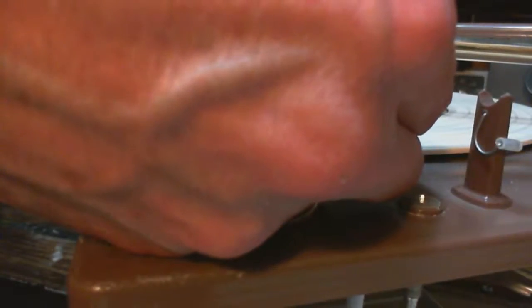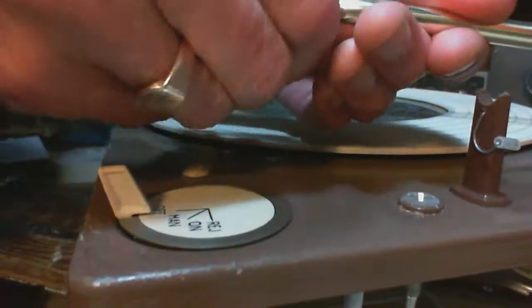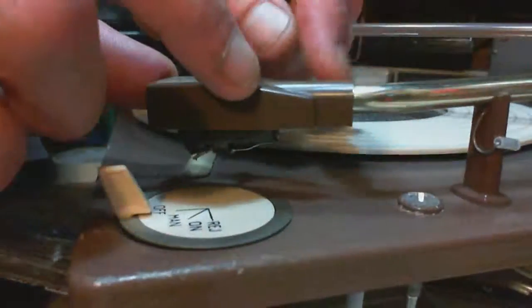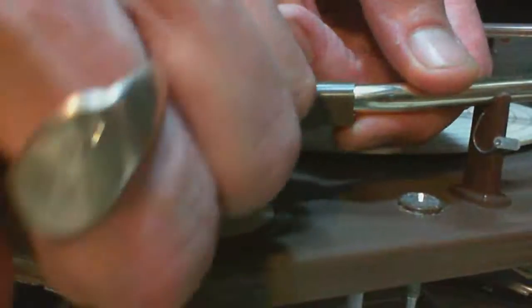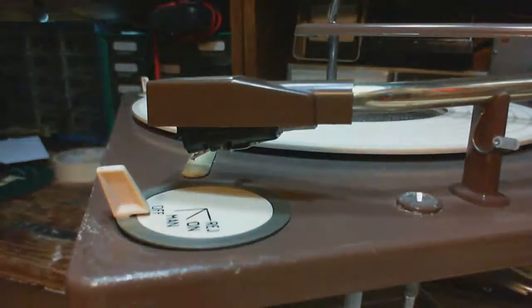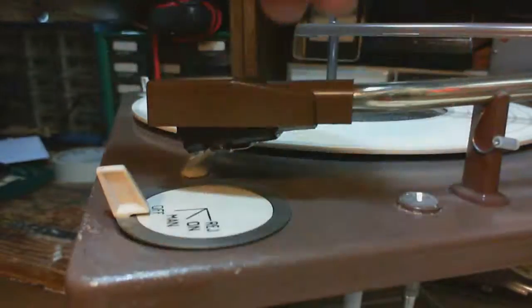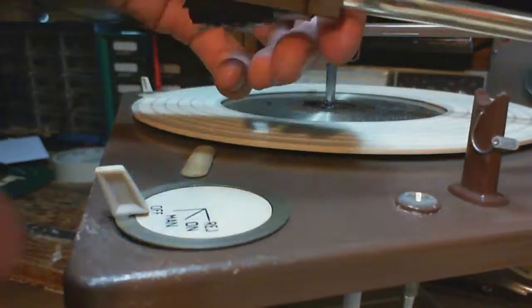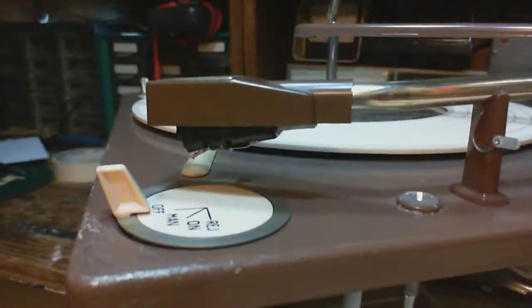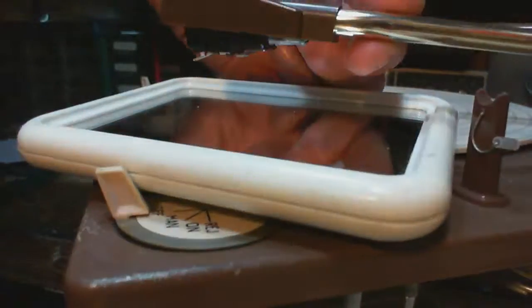We'll rotate this again. Hoping nothing bad happens at this point. The reason this is hard to rotate is not just a tight fitting, but the screw that goes up in the bottom cut into the metal and distorted it, so it's protruding out. I better take a look with a mirror here before I try this. If the holes aren't lined up, I'll never succeed. Not lined up.